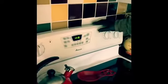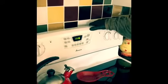Okay, so when you're discussing, for instance, the safety items for this kitchen here, where would we be looking for that? Yeah, so this here is your oven/range. This is what I was talking about in regards to the anti-tip brackets. You can't see the brackets, but they're mounted on the ground and underneath the range itself. Okay. And so do you typically pull the oven range out to check? Yeah, so how I test it is I just carefully pull, make sure I don't break the top here. I pull it to see if it can come towards me. And if it can come towards me about 6 inches, I know the brackets are not there.